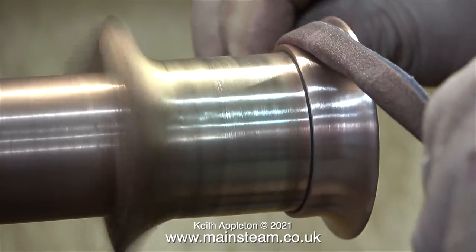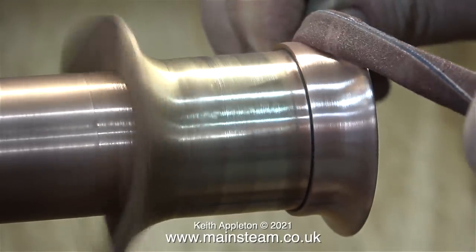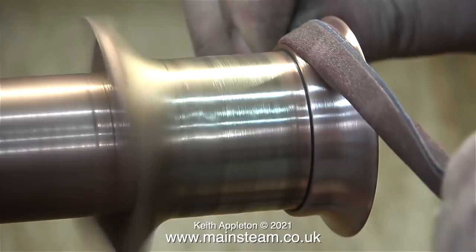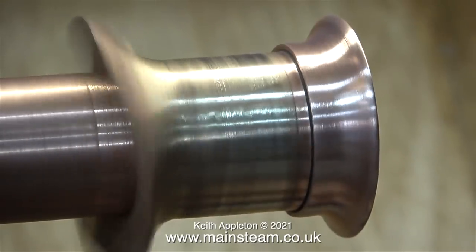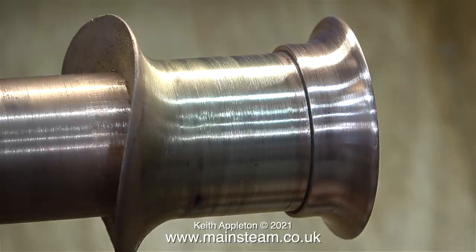The general idea is once I've roughened up the top cap, I will sit it in the bath of copper sulfate for about two and a half to three hours while I get on with some other jobs in the workshop. Once it's been copper plated, I'm going to put it back on the mandrel and polish it up using wet and dry sandpaper followed by Scotch-Brite, then use my polishing spindle to make it shine and finish off with some Brasso wadding.